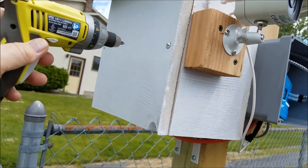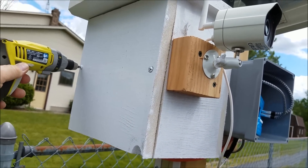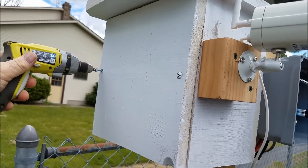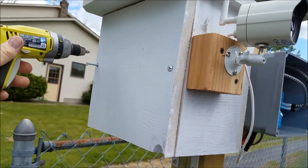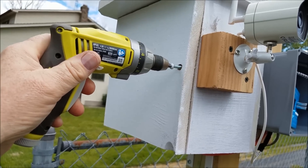I made this battery box. I wanted to keep as much water off it as possible. A little water won't hurt anything, but it's not totally air-sealed because I wanted it to vent a little bit. With only 20 watts of charging you're not going to have a big gas problem.